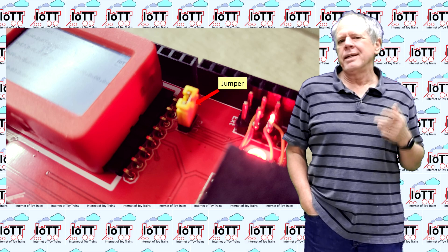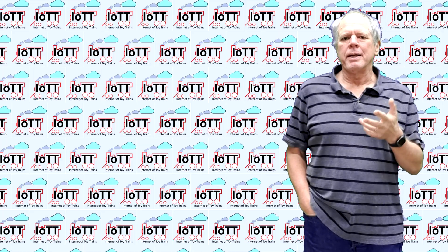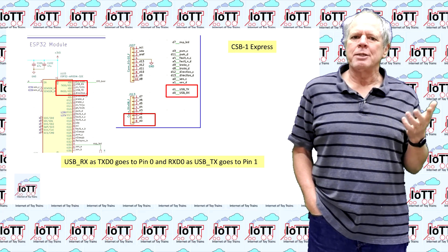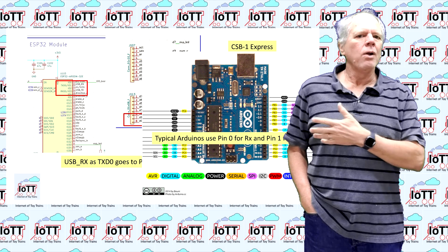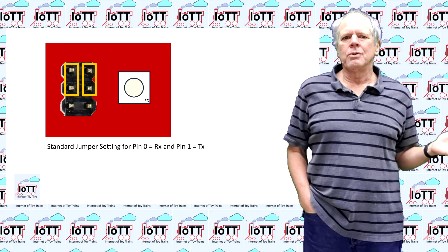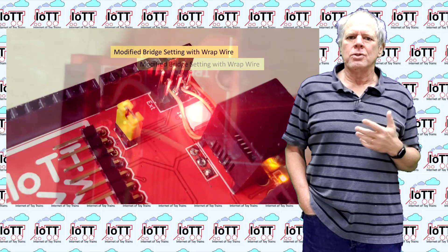The last modification is a little surprising and it took me a while to figure it out. Despite the 3.3V configuration of the serial port, I could not see any communication taking place between the IoTT stick and the CSB1 board until I swapped the RX and TX pins. And indeed, once I checked the schematics, it became clear that the CSB1 is using the opposite sequence of RX and TX on the first two IO pins compared to all other Arduino boards. The fix is simple: all we need to do is remove the port selector jumpers and replace them with diagonal connections of the pin headers. I conveniently used wire wrapping, but you can also solder wires across or use jumper cables.